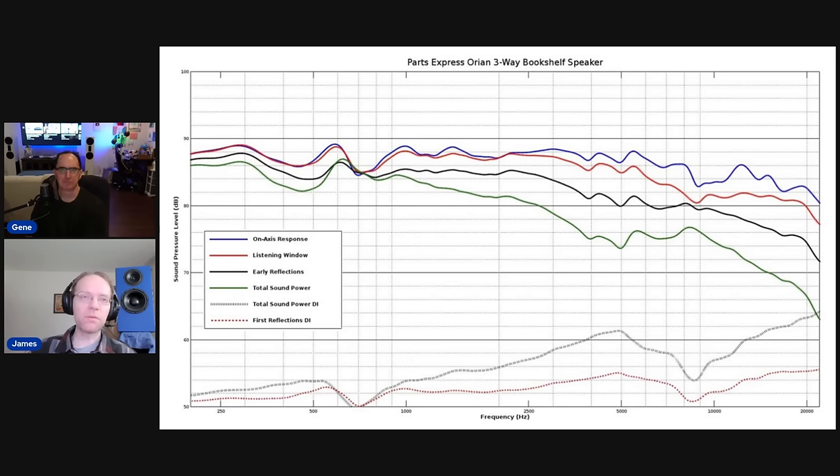There's a slight treble drop-off, which may partly be due to how coaxial speakers are measured — the woofer can reflect the tweeter's sound, making it hard to measure treble accurately. As best as I could measure, it's a warm speaker: treble is somewhat attenuated while the bass is slightly elevated. It's a non-fatiguing sound. If you want more treble, you can add a shelving filter above 5 kHz and boost by a couple of dB.